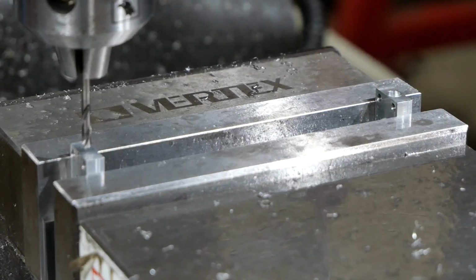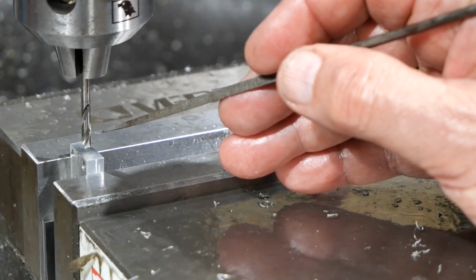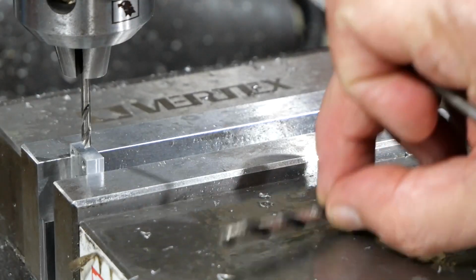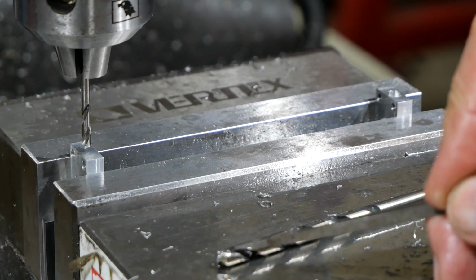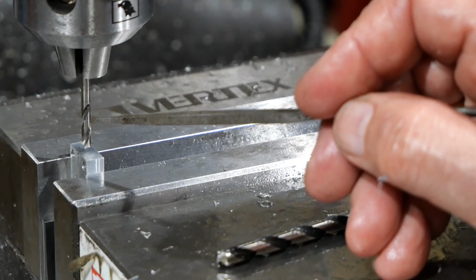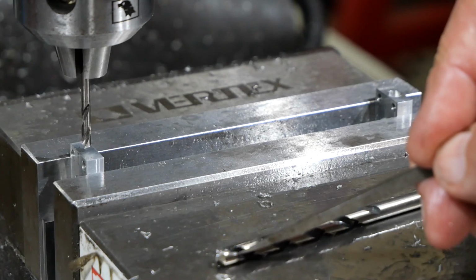So what I've done is use a stiff drill as a pilot. Oh, and the other thing is the depth. It calls out on the drawing for a depth of 4.76mm or 0.188, and that's from the drill point. So you finish up with a hole with parallel sides that are less than that depth. That's by design. Anyway, so I'm going to take this drill down to about 4.4mm, and then it'll be the guide pilot for this guy to make sure he stays on centre.